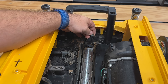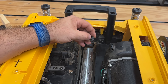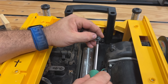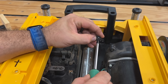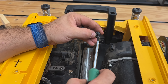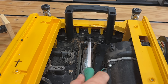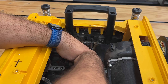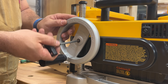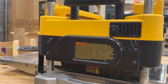Next, we're going to take off this spring plate. There are two screws. The reason I already took one off is these have Loctite on them and they are crazy hard to get off. They also have a really weird inset for the screw, and I was really afraid I was going to strip it. It took me a while with a handheld screwdriver, but I got them both loose. There is also a spring right behind here. Remove the handle while holding it as you loosen the screw.